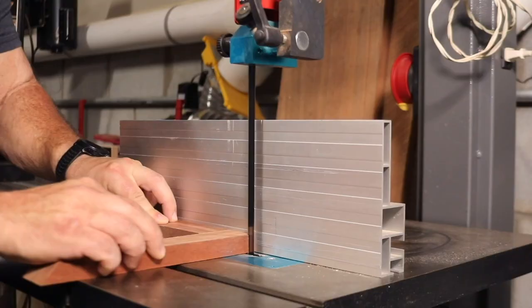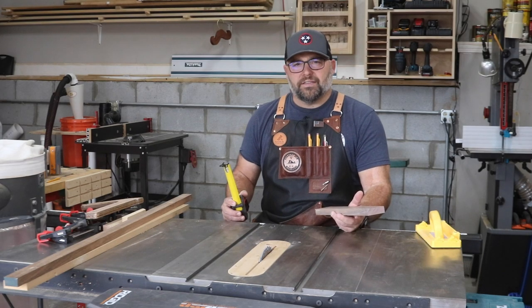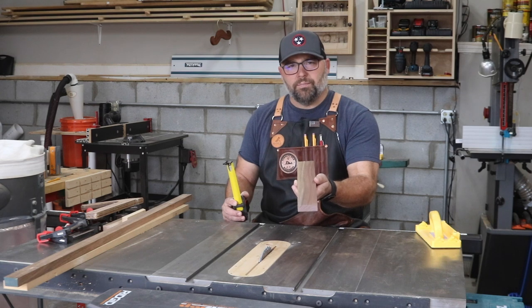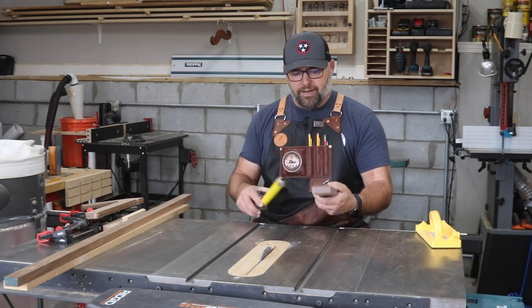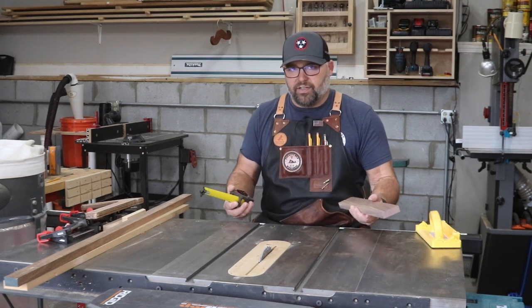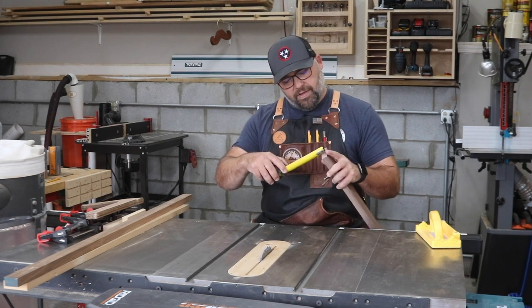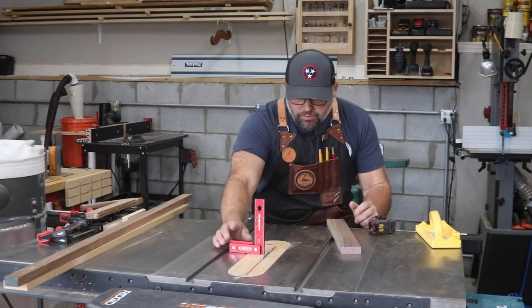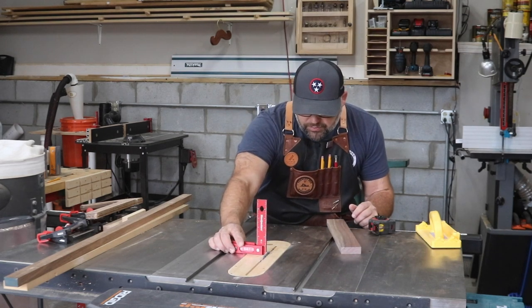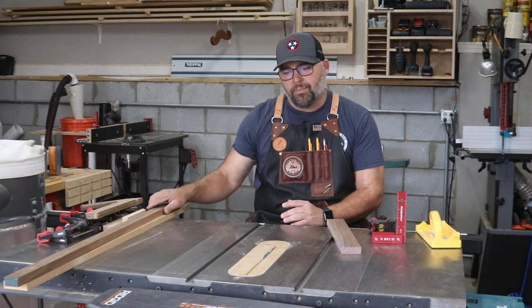Stay tuned, I'm going to show you how to do it. The first step of setting up this cove cut is to take the piece that you want to put the cove in. I'm just going to use this piece of walnut for an example. It's about two and a quarter inches wide — length and width really doesn't matter. What does matter is it's three quarters of an inch thick and I want to make my cove cut three eighths of an inch high. So I used my 641 square here to get the blade at three eighths of an inch high. This is important — we want it at its final height so that we can set our fence in the proper position.